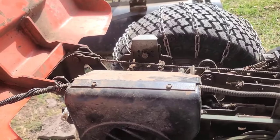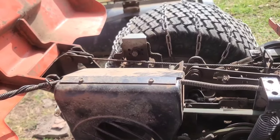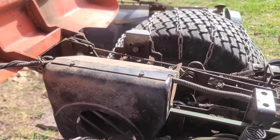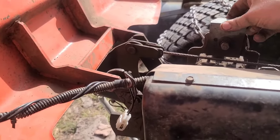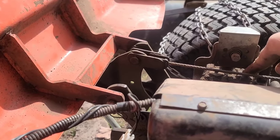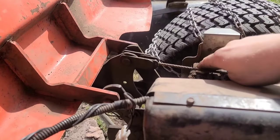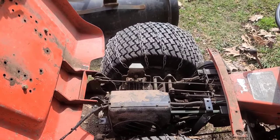Now I'm going forward - I'm pretty sure this one keeps going. Yep, this one keeps going. I can put this one down - if I can't push down this one while there's pressure on it, and then if I take the pressure off I can push that down - so that's the valve that's giving us the problem. It'll creep forward at low speed and not stop because it's leaking.